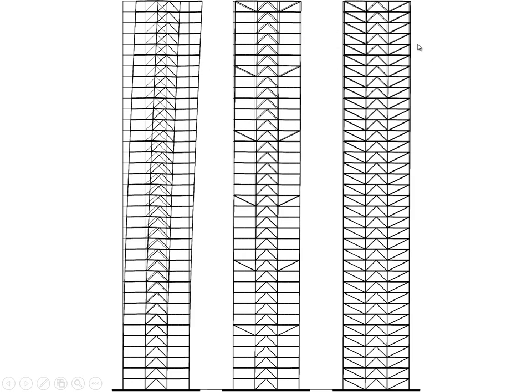In this case we've left out five diagonals for every one we've kept on each side. The deflection is much better than the single-bay case, though not as good as full triangulation. From an economic analysis point of view, with about 17 percent of the members we're getting 80 or 90 percent of the benefit — this reduced-diagonal case is much closer to the fully triangulated result than to the single-bay result.